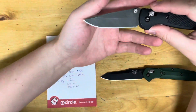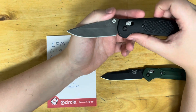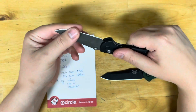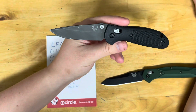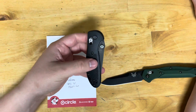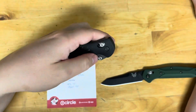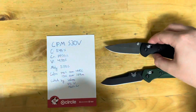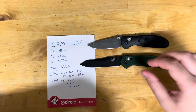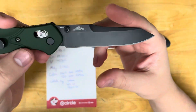What makes S30V different from a lot of the budget steels, especially for edge testing, is that these strop back way better and are easier to handle. If you make your own knives, S30V and the Crucible Particle Metallurgy steels machine a lot better — that's from personal experience. I made some knives in 4V, and despite having harder carbides, 4V was way easier to sharpen and machine compared to something like D2.